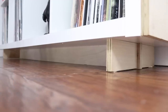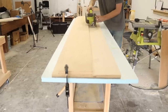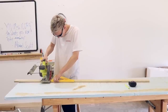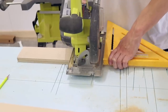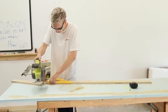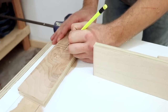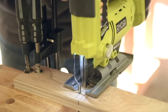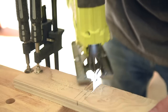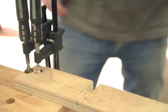So the base overall is pretty simple, but it's got this cool little pop-out on the sides. The first thing you need to do is get a piece of plywood — I cut mine to three inches wide. Then Caleb cut all of the pieces to length, which will all be in the written article on my website linked in the description. Here I'm marking the outline of my middle stretcher so that I could cut out all the pieces so it can pop out of the sides. I'm pretty sure this is some sort of lap joint — basically I used my jigsaw to cut out the thickness of my horizontal stretcher on each of my sides, but I only did it halfway up.